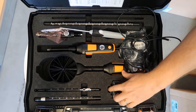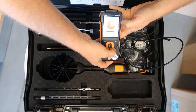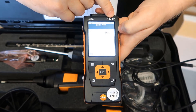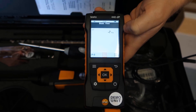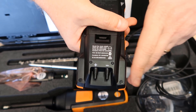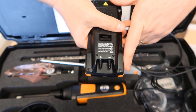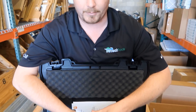The main component of this kit is the Testo 440 itself, which is the hub of all the operation. This is the Testo 440 DP, which means differential pressure — it's a very accurate, finely tuned differential pressure manometer. These are your plus and minus inputs for your manometer, so this is a micromanometer or precision manometer. This is not the type of manometer you typically use to measure gas pressure, although you can use it for that purpose.